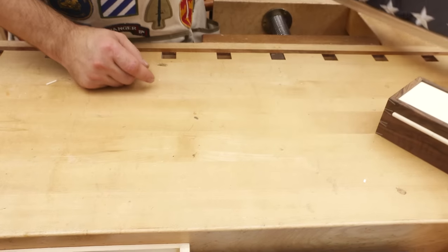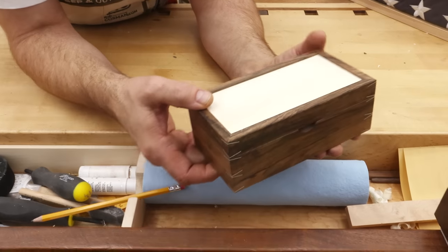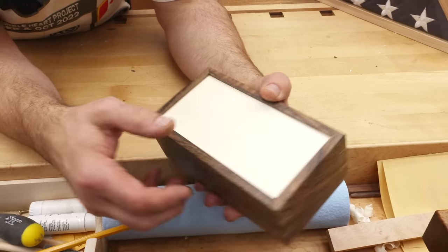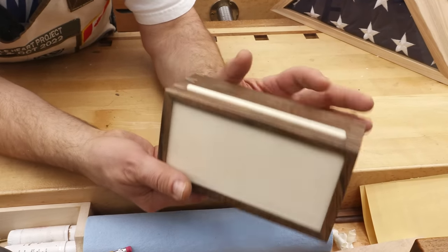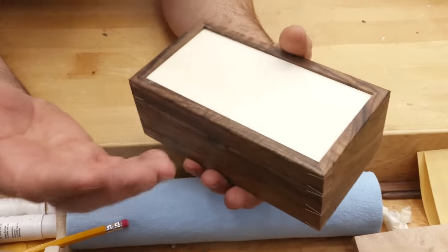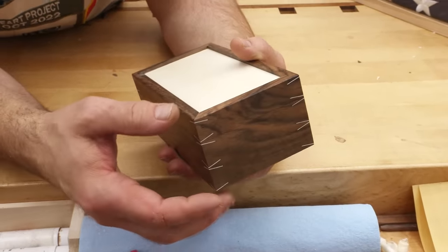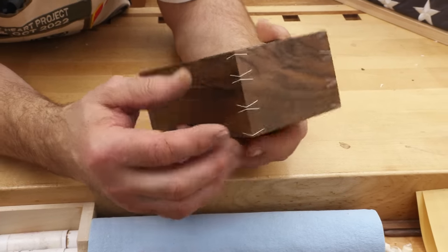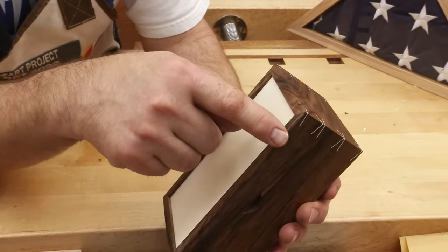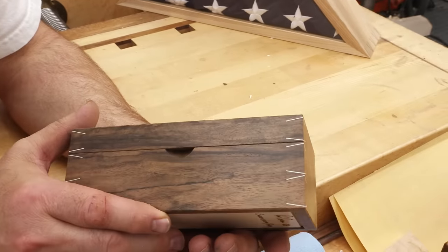You can also use this on a 90 degree. Here is a box I recently did, a little wood hinge box made out of English walnut. The accent wood is holly. This piece on the lid and on the bottom, the hinge, and this accent is holly, which is just a nice white wood that comes out of the eastern United States. You've got a 45-degree that is just glued, which isn't super strong, but the holly is actually running across the grain, or across the joint, so that should give it a fair bit of strength.